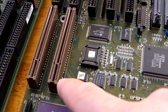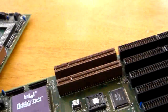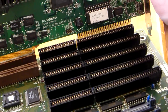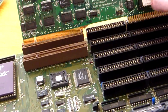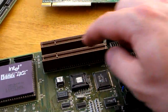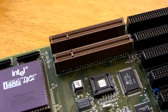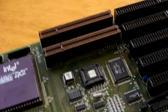This motherboard does support two VLB extension slots. This is the ATI video card - as you can see it sticks in. The piece at this end is your 8-bit, the extension down here would be 16-bit, but it doesn't need it because the extension piece at the end is 32-bit. And as you can probably see, that looks like a reverse PCI slot - and you'd be correct. This 32-bit slot was used later on to create the PCI slot. That then allows you to use PCI video cards, sound cards, and so on. For video, this is the leap that computers needed.